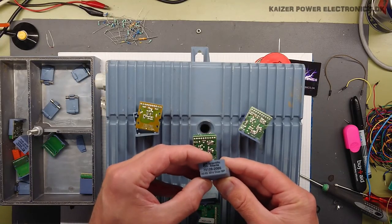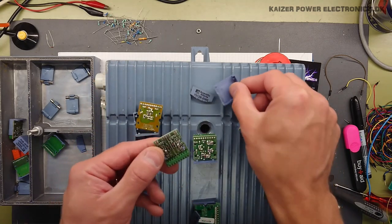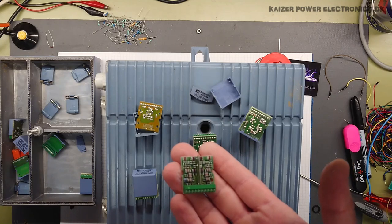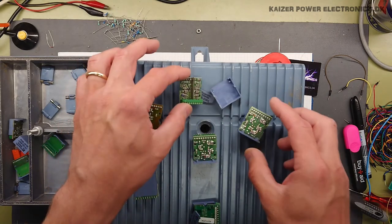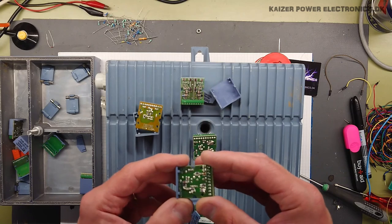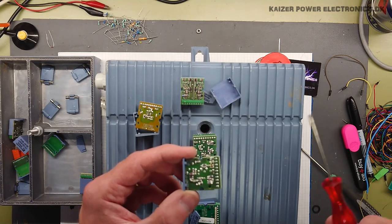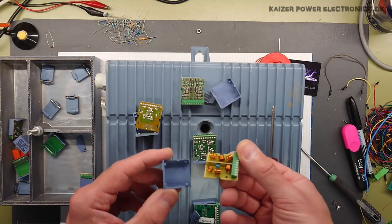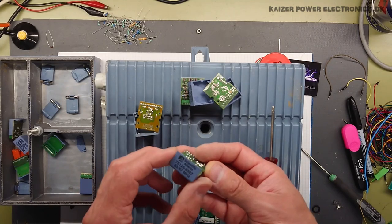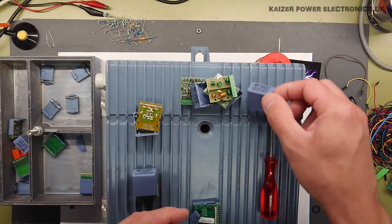These are rated for 15 to 21 dB gain at one gigahertz bandwidth, with a 20 to 65 MHz dual bandpass. Looking at the back it doesn't look like much and the plastic is pretty brittle, but inside we can see a huge mess of inductors, capacitors, and some resistors. Then we have a diplexer at 65 to 87 MHz — on the inside all we have is inductors and a single capacitor. There's an identical diplexer with just different markings.